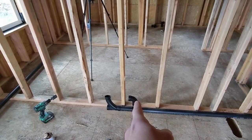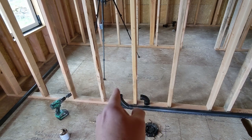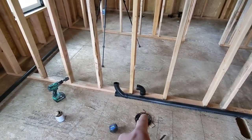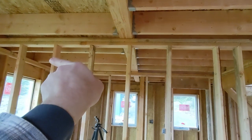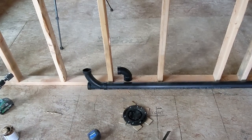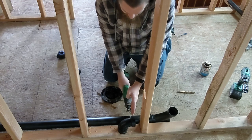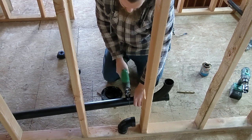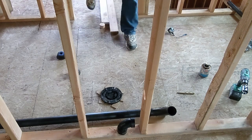That's going to be where all of the sink drain goes, and it's also going to be the vent for the bathroom group coming up. Essentially the sink is going to wet vent down, and then all that connects in from the shower and the toilet. They are wet venting up past the sink, and then right here it's going to come up on this side of the beam into the attic area — draining across with a slight slope over to here and then taking off. That needs to be a two-inch for the vent in order to satisfy the requirements of the code. I'm going to line this up right here with the edge on the interior of that lift and we're going to try cutting it with this sawzall.